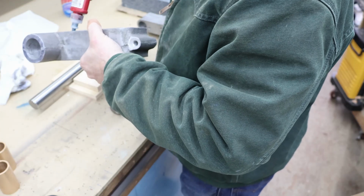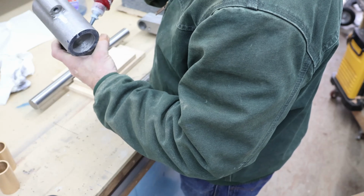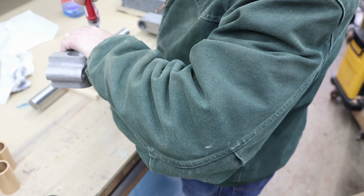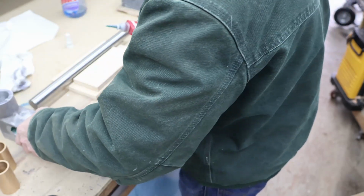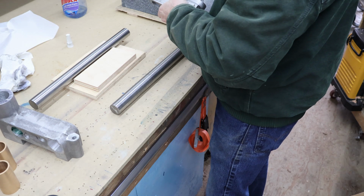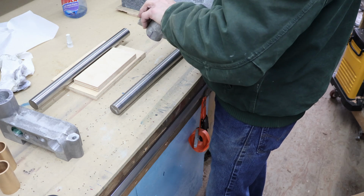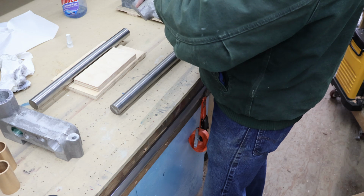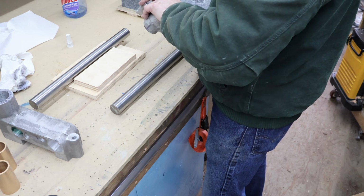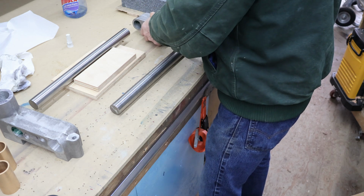And these fit tight enough, it's not going to take a whole lot of Loctite in here, but we're going to add a fair amount anyway. Whatever squishes out, we'll just clean up. I didn't bother to clean up the ends of that. In the lathe, they're just saw cut because when I finish out these castings, they're just going to be, I think, painted over anyway.